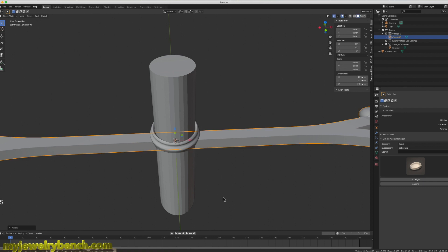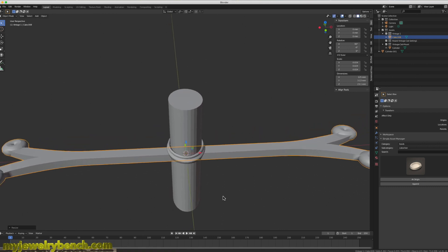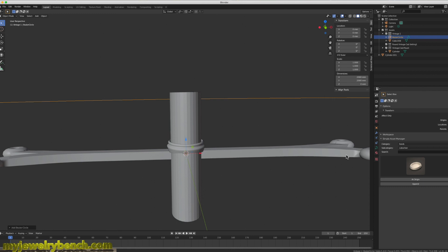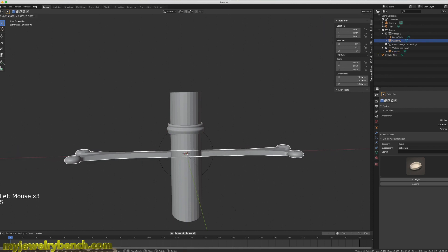Don't forget — you want to increase the print size of your 3D printed objects because in casting they will shrink a little bit. You always want to design around maybe a two percent shrinkage. The caster I'm using for this particular job indicated he'd like me to increase it up about five percent to cover any casting errors. Silver is a little bit harder to cast when using 3D resins, but gold and platinum seem to cast really well.